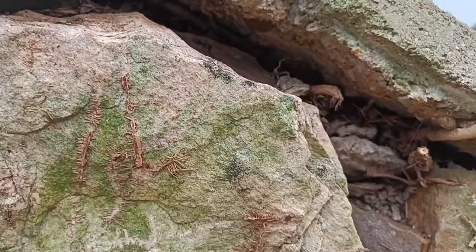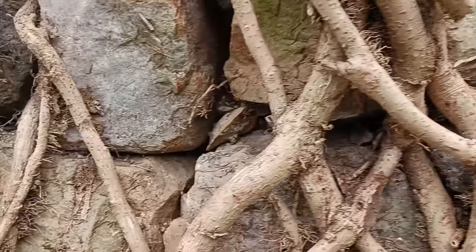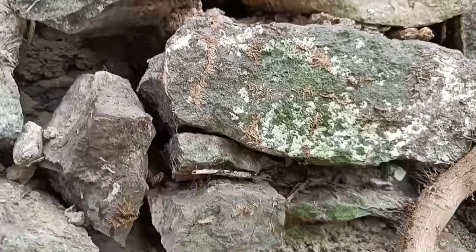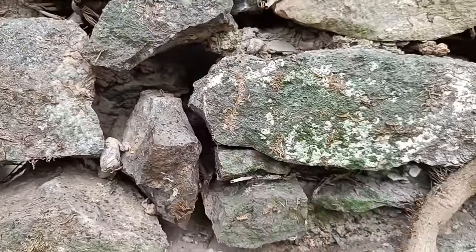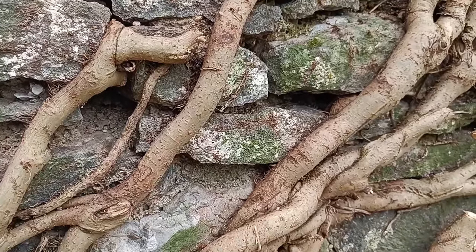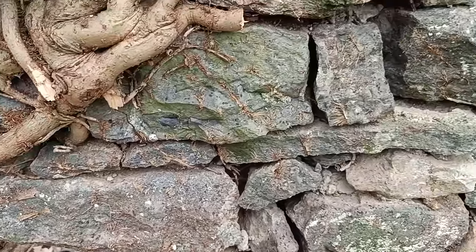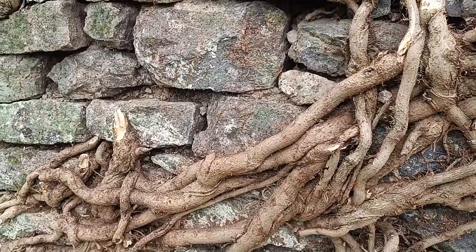But again, here there's nothing. There's not a lot in any of these joints to repoint to anymore. It's gone. Further down you go, and this is the lintel of the window, and further down you go from there, you start to see the ivy hasn't taken too much of it away, so these portions may be repairable. But we're wondering if this may need to come down to window lintel height and be rebuilt from that back up for safety more than anything.